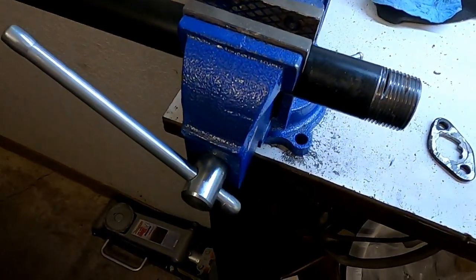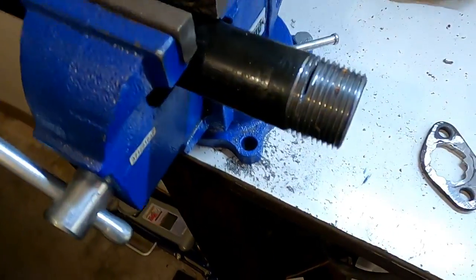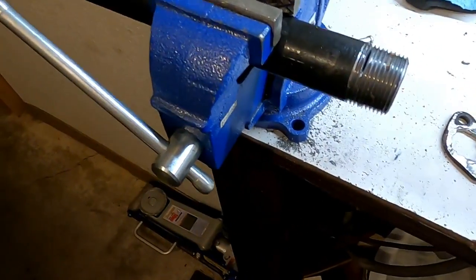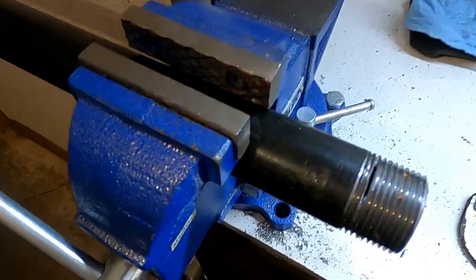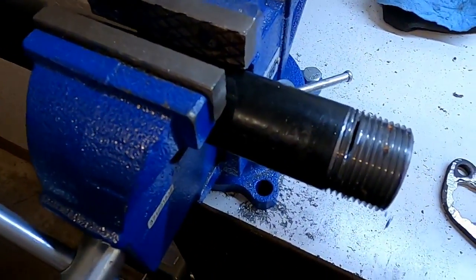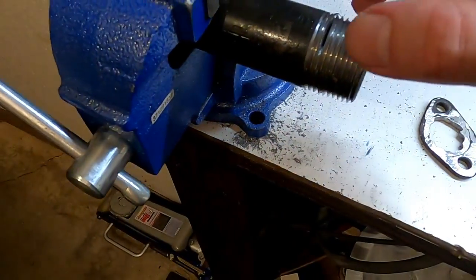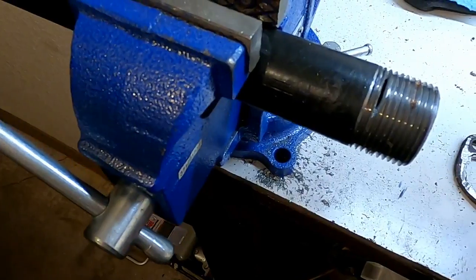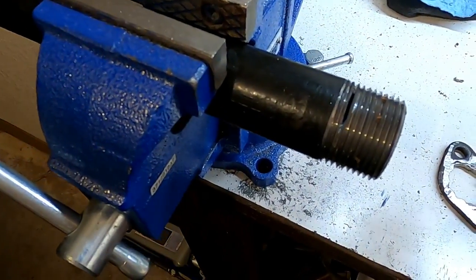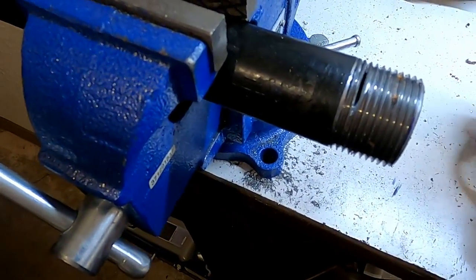This is just a piece of one inch black pipe. It's a little bit too thick than we really need, but it shouldn't rot out or anything. And it was cheap, so why not? The whole point of this is to make it cheap. I've already marked it with my hacksaw about where I want it. I'm going to cut most of the threads off, but I'm going to use some of the threads to help get penetration into the pipe and weld the flange on, since I've just got a wire welder.